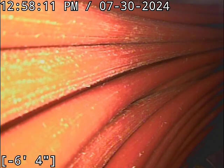This line, for instance, probably looked perfect until they buried it. But there's also some stuff sitting over top of the line here. You've got some big rolls of carpet. You've got some rocks and whatnot. If the line wasn't bedded very well, it sometimes doesn't take a whole lot of weight to cause settling issues. Everything beyond that section there, before and after it, all looks like it has good slope and grade, good flow, and doing its job.